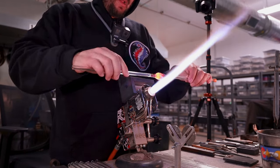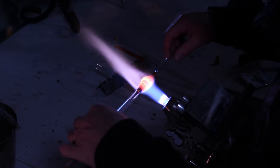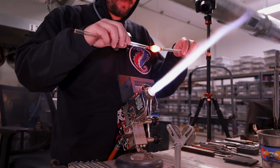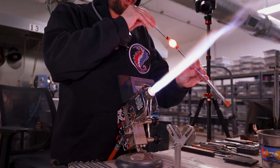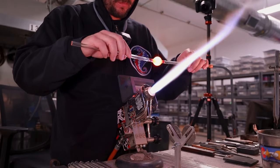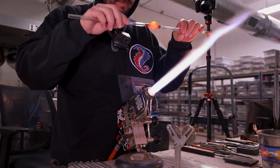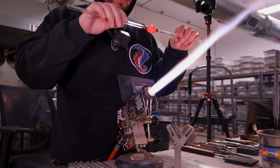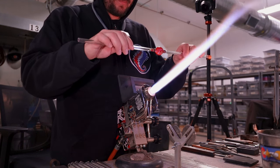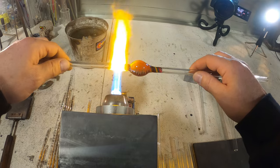Right now I'm just worried about really getting the kicks blown around. Later I'm going to take the terminations and size them and then add them into the ball. Getting pretty close, getting that good football shape. I'm making adjustments, looking in there, checking my cue lines, making sure everything is where I want it as it's cooling down and showing me what I want to see. It's looking good — there's the first show of the kicks, they look pretty good.